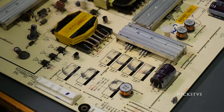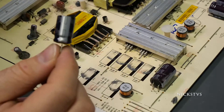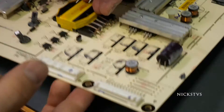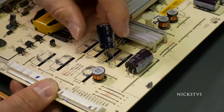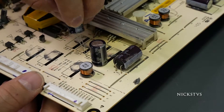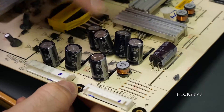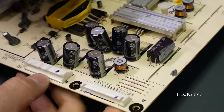We're going to go ahead and put our new capacitors in. One thing you'll notice is the board is marked with a black bar on one side — that's indicative of the negative. On the capacitors we also have an indication of our negative, which is always the shorter lead — so the long lead is positive and the short lead is negative. We're going to make sure we line that up. The capacitors I'm using are actually wider than the originals so it's going to be a tight fit, but that's okay. Before doing anything more, I'm just going to confirm and double check that I have the correct orientation for each and every one of them.